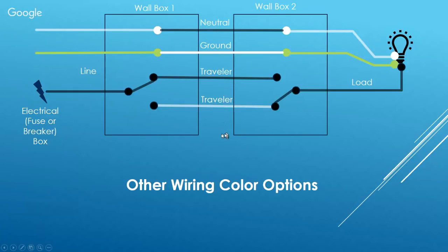If you have one of these alternative wiring setups, take time to go back and look at exactly what was done. Check your voltages — I've left a link in the description to videos on installing smart switches and smart three-way switches. It's important to understand where your line wires and load wires are and the purpose of each, so when you wire in the smart switches you won't have any problems.